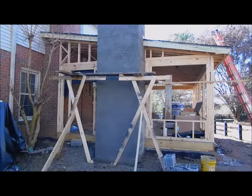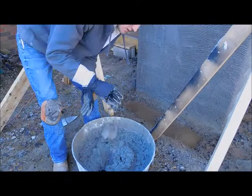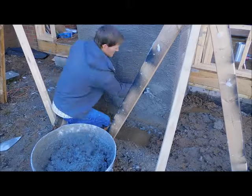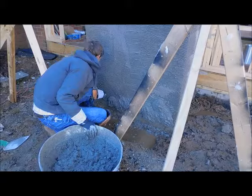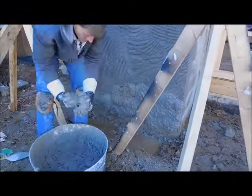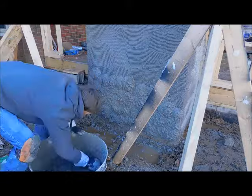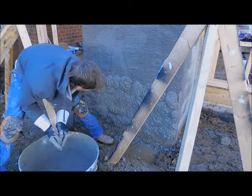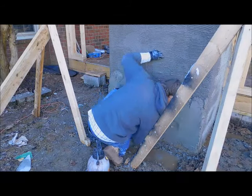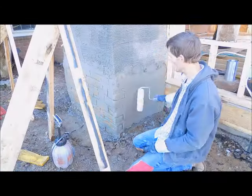All the block is done. This is the scratch coat — it goes on before the concrete because it gives a good texture for the concrete to hang onto rather than just smooth block. Let it dry, then mix a special blend of mortar mix with a decorative or deck concrete mix — it's also called decorative mix, made for stamping and carving. You're going for about an inch and a half to two inches thick on the wall when finished. You can go up to three inches, but it's difficult. I have another video on my channel that goes into this in more detail.